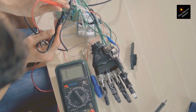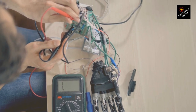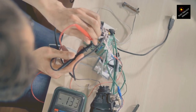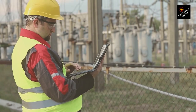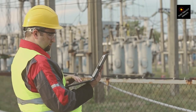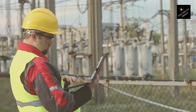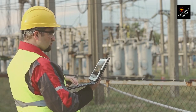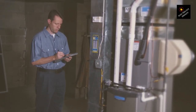If your motor is tuned to the beats of 60 hertz and you plug it into a 50 hertz power supply, or vice versa, it's going to stumble. This mismatch can lead to lower efficiency, increased heat, and even damage over time, because the motor's not operating in its sweet spot. So if you have a 110 volts motor and need to run it on a 220 volts outlet, even if you use a transformer to step down the voltage, if the frequency doesn't match, you're only solving half the problem. You might need a frequency converter instead of a voltage transformer.